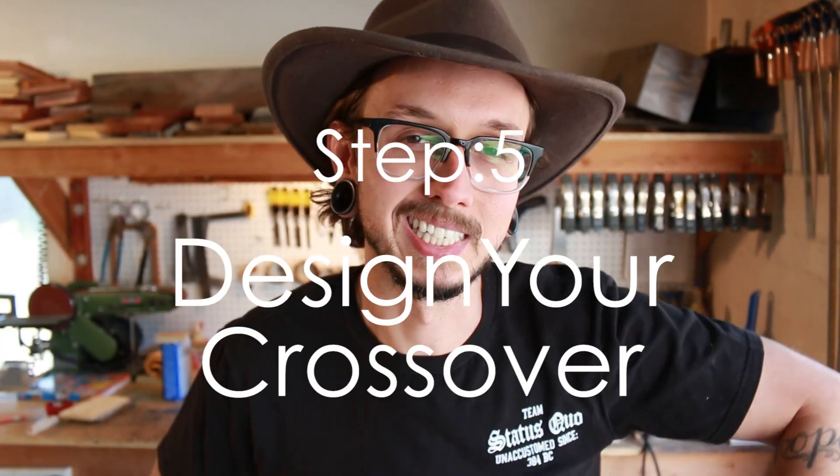Step five: design your crossover. This is a step where you can take two roads — either pre-designed or you-designed. There are good pre-made crossovers out there. What you'll do is find where you need to crossover your speakers and then find a pre-made crossover that gets as close as you can to your crossover point. Crossover design can be really complex, but if you're interested in the subject and want to learn how it works, I definitely suggest making your own. This is where a lot of the meat of speaker design lives, so if you really want to know how great speakers are designed, this is the hole you should dive down into. One thing to consider is keeping your crossovers outside of the enclosures or in a spot that's easily accessible within the enclosure — this allows you to tweak and change your crossovers once you're done with the speakers and see what that does to the sound.